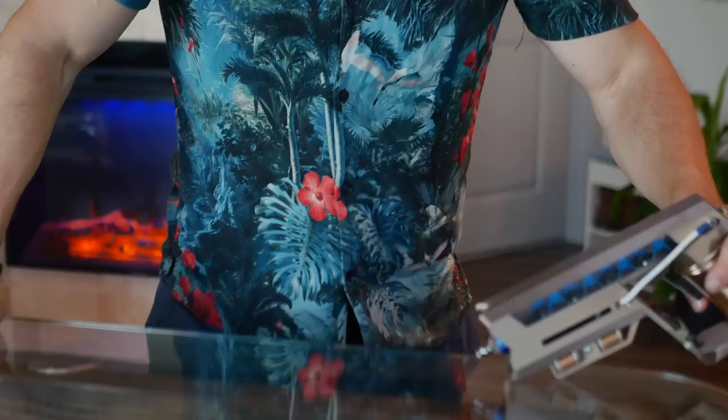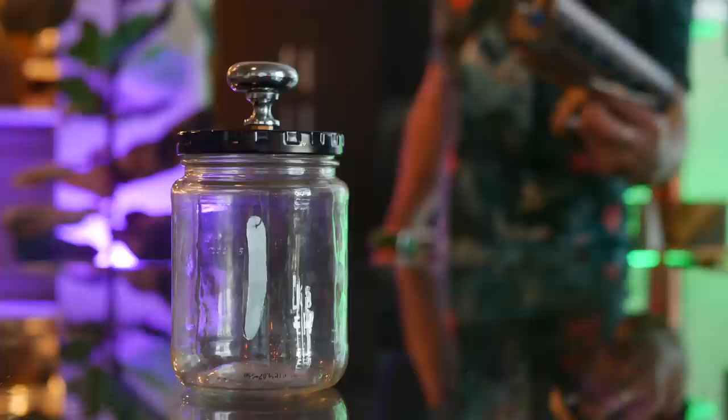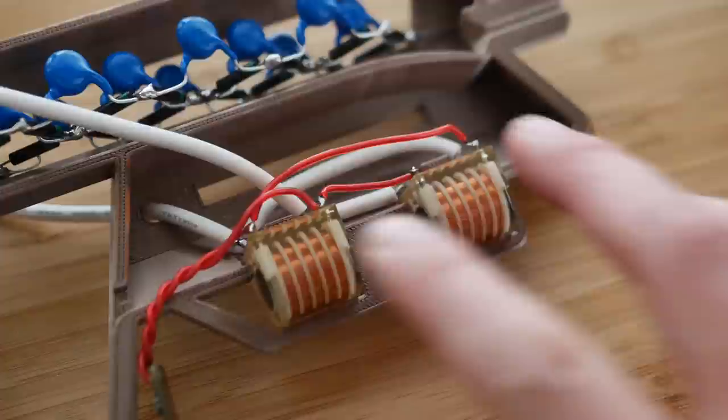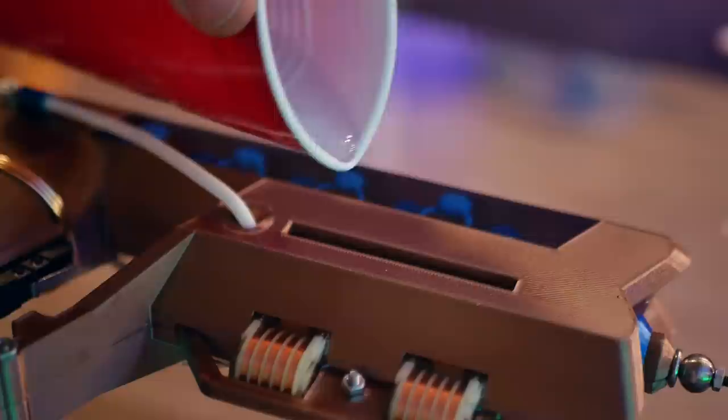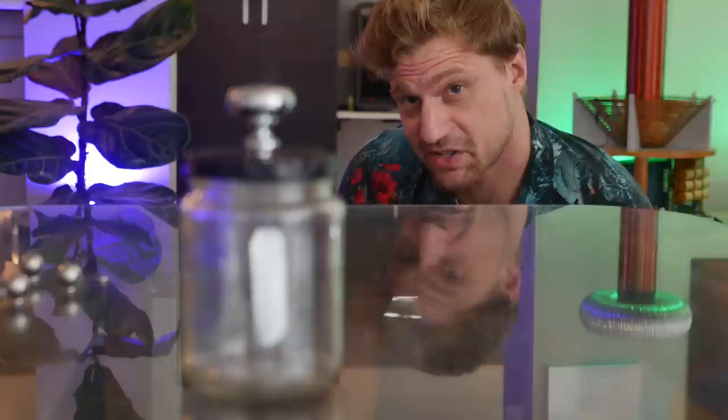There's a lot going on inside a small package, so realistically I give this a 50/50 chance of blowing up or shocking me really bad the first time it's turned on. As for shooting static, let's first test it with an electroscope — these are ancient pieces of tech that rely on the principle of static repulsion to measure charge; the foil inside spreads apart if enough voltage is present. The high voltage transformers under the barrel turned out to be a poor idea — the output of the multiplier was just too close, causing it to arc to the transformers. The solution: lots of resin, lots and lots of resin, and a bit of prayer. I also added a deflecting ball to help focus the static to go further.